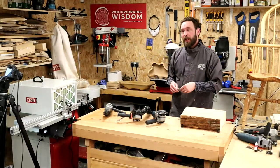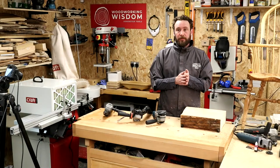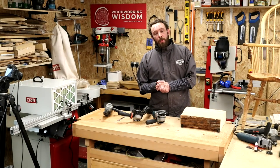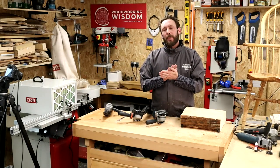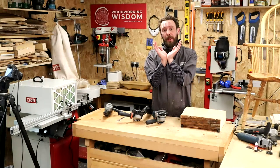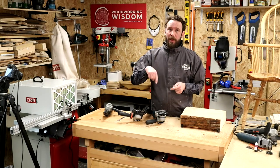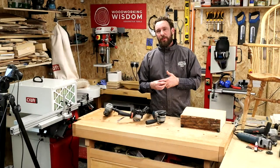Good stuff. So I've had a question from Nigel here. Can those circular cutters be removed and sharpened by rubbing them on a diamond card after they've been rotated and blunted on all edges? So I wouldn't go trying to dress the outside of those cone-shaped tips. You can get the diamond cones, which will go into the little chamfer, and they can sometimes dress them. But once you've been around that circle and blunted all sides, I think it's time for a fresh set.